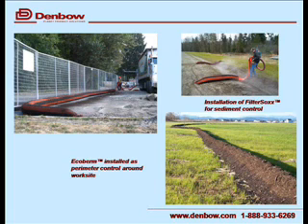Looking at a few of these BMPs in the field: on the top left you have a compost filter sock that is blown in on construction sites for use in sediment control, replacing things like a silt fence or a straw bale. They are tested — we have the testing to back up that filter media. They work very well, especially for use on concrete, because they're heavy and conform very well to the surface. They don't need to be staked because of their weight — about 25 to 30 pounds a foot for an 18-inch sock or a 450 mil sock. They don't move.